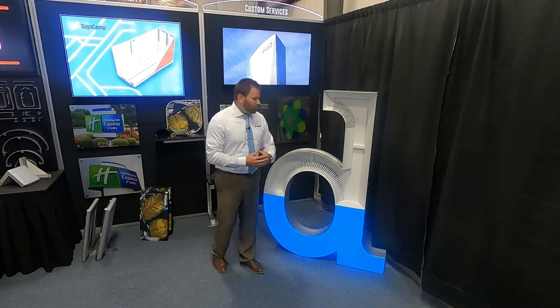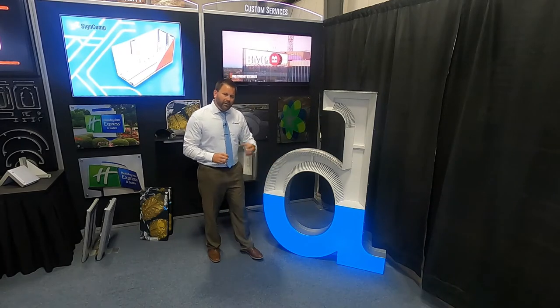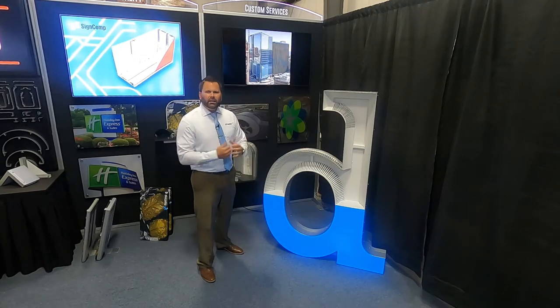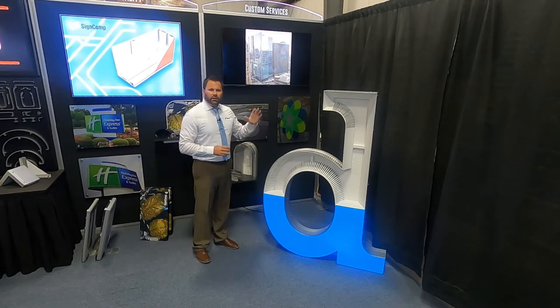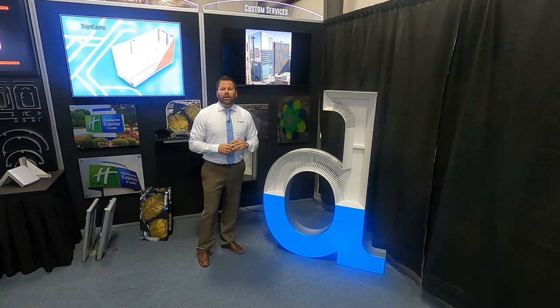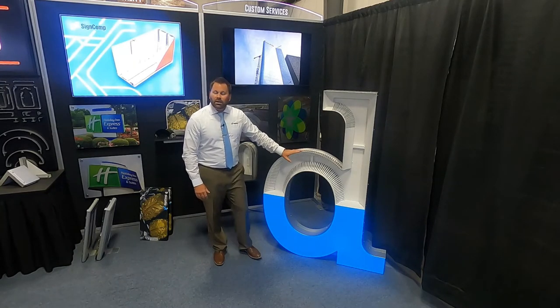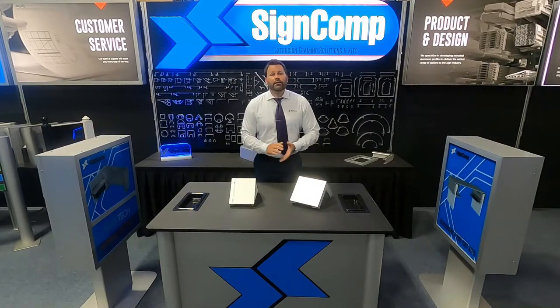That's the SineComp advantage — we extract that information and provide the proper curve cut so you're not being overcharged or getting an inappropriate amount of cuts. We don't want too flimsy a piece of extrusion, so all areas have been put into a drawing and sent to our shop with the proper cuts. This is also a great example showing the matte white paint so the LED lights can reach the perimeter. There will be a link below to see neat applications using our custom services. Keep in mind it doesn't always have to be flex frames — standard and EconoComp can also be curve cut, as can our architectural line. Please submit your drawings to us.